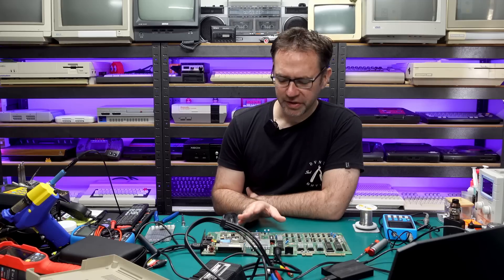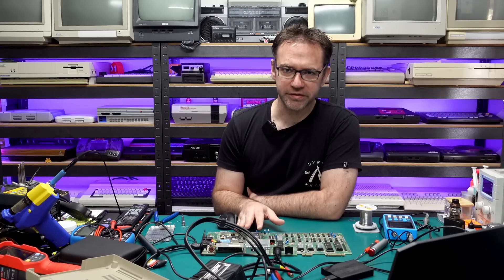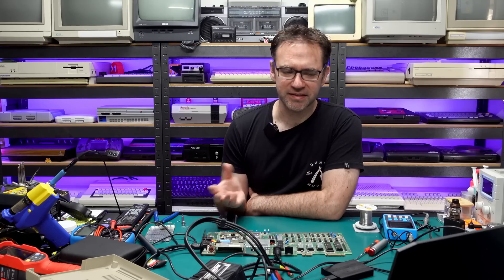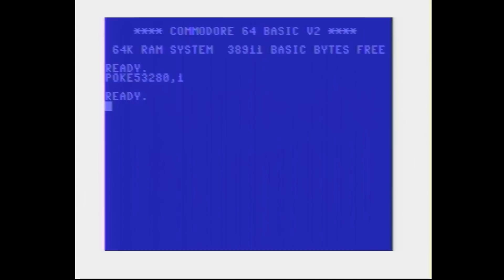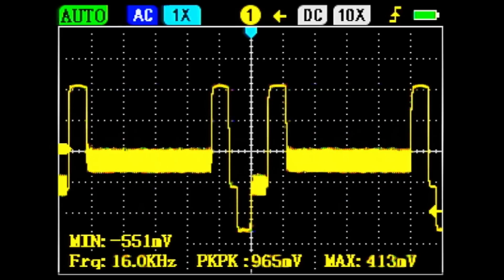I don't really plan on doing any major changes to this board, so I'm not going to scope out the whole video circuitry — just doing simple little tweaks that have the biggest impact. Let's change the border color to white so we've got maximum variance in brightness and see what it looks like on the oscilloscope.